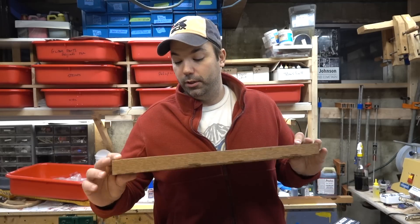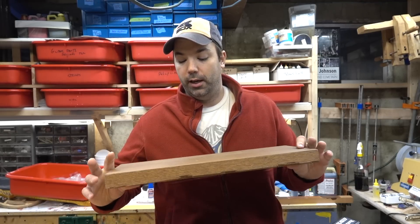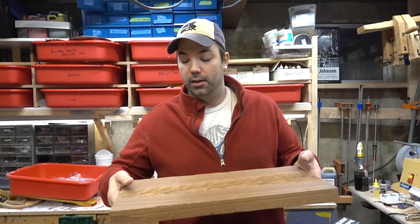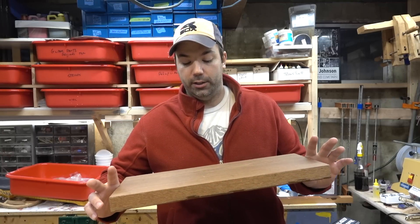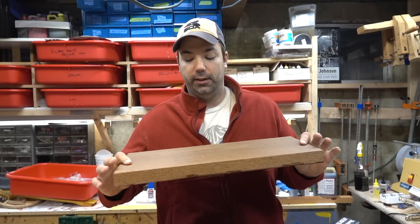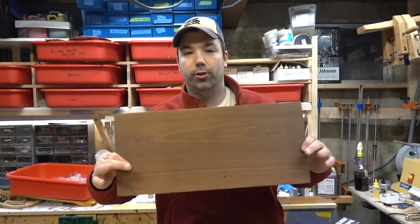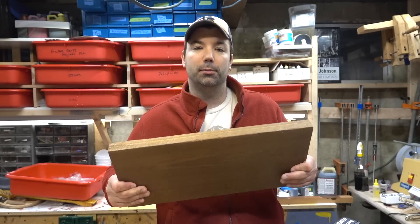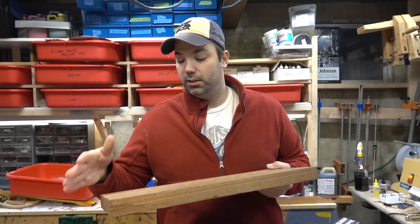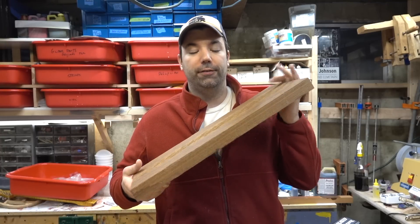All Hardwood and Lumber here in Chicago had some heat-treated ash that I bought a couple of years ago, and essentially that's the same thing. It gets a little bit darker in ash but it dries out the body significantly. Northern ash is what they use for baseball bats, and this piece has been heat treated — it's significantly lighter, a little bit easier to machine, and it's really significantly different.